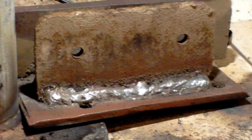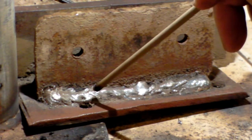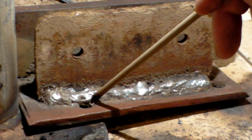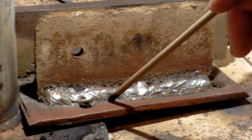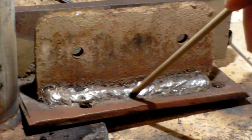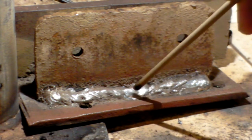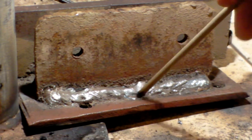Here's the scrap piece we're going to be using today. As you can see, I've run a whole bunch of beads over this trying to get the settings to lock in — it's been a bit of an adventure. For the 6011, it's going to be the same exact technique as before: you're going to come in, tap your rod, get your arc started, bring it in, and then whip it across — back and forth, back and forth. When you get to the end of your bead, you're going to come out, come back in, let it fill in a bit, and break the arc off. Because this is a 6011, I'll be coming back in and filling in that crater with a quick restart, quick fill, and break it off.